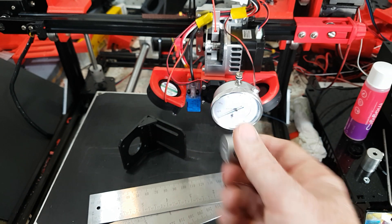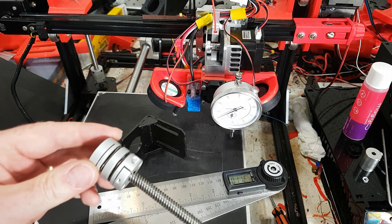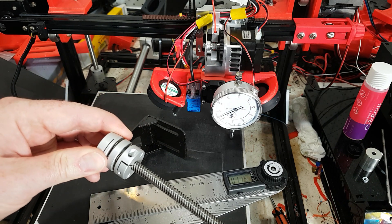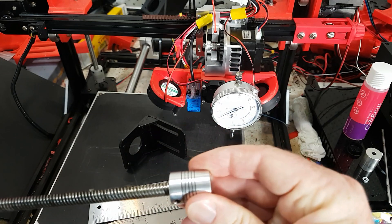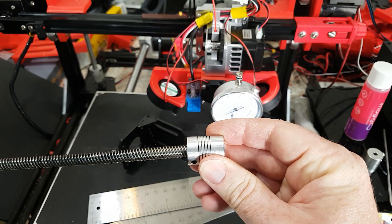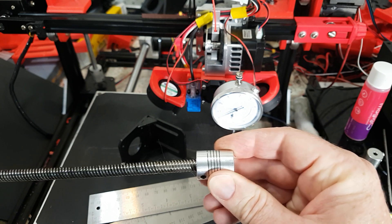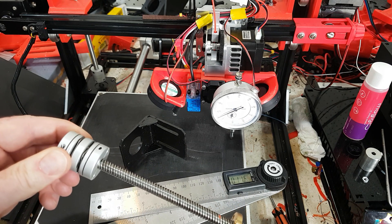So I went and bought more expensive ones. This is a diaphragm one which has two pieces of flex steel in it, and that steel bends. These are perfectly fine except they're much stiffer than the cheaper ones. I really think that for 3D printing you want something that's really flexible, because the frames are not that rigid. But there's nothing wrong with it.